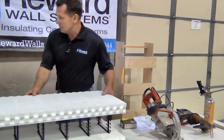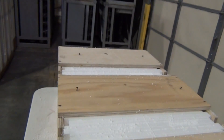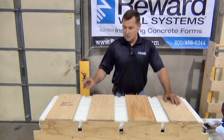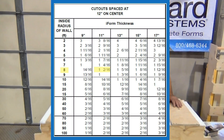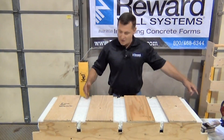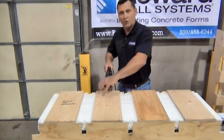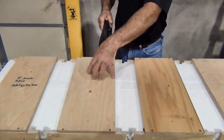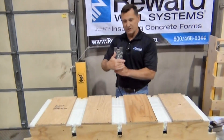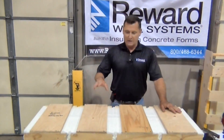What I did is I built a jig out of lumber that will cut one form for each cut. Once I determined my dimension from the manual, I found that for this eight-foot inside radius I need to take an inch and an eighth out for each segment at 12 inches on center. I made my guides so once my saw slides along each one of these edges I'm taking an inch and an eighth out. This jig would really only work for this eight-foot inside radius with my Makita saw — make sure you use whatever type of saw you have. The table width determines where your guide is at. It's fairly simple and straightforward; make a jig for each radius and then get on the job and start cutting.